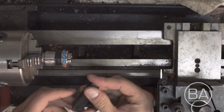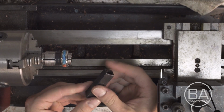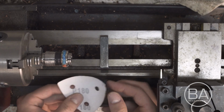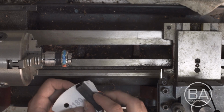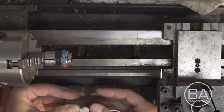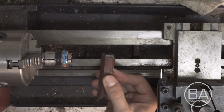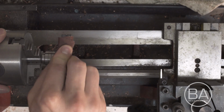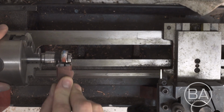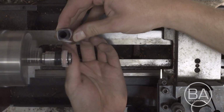Once the inlay is all in there and the glue is fully cured, it's time to start sanding. You want to use some kind of sanding block to have a nice even finish and to avoid marking up the titanium. If you don't have any power tools, you can certainly do this with a bit of elbow grease and some patience, but a drill or a lathe will help out a lot. And just keep sanding away until everything is nice and flush.